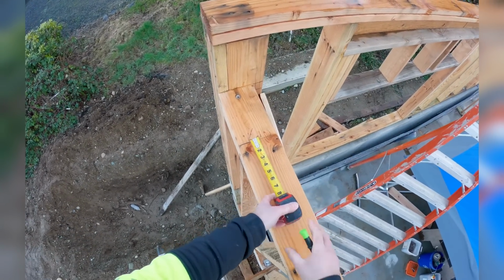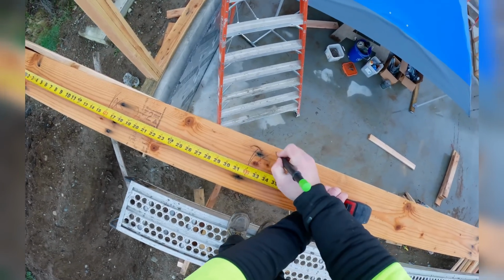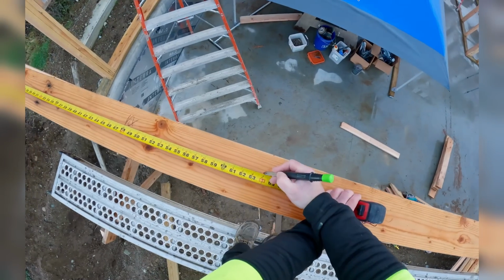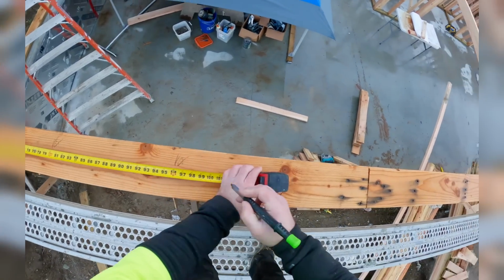You'll notice that the end wall is framed to the top of the I joist. This wall is framed to support the I joist. I'll get into all of that later as we go through this process. Right now, I had to offset my layout because of the joist flange width. Do that to the first one, and then you can just keep pulling 16 centers.